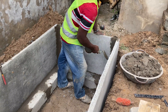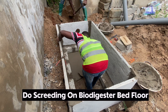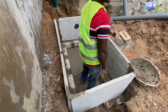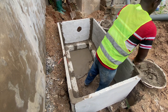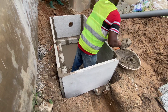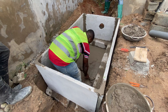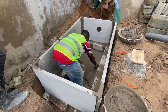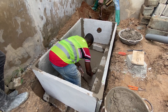The screening is being done at the same time as the porous slabs are being laid on the ground. We are using porous slabs in this case because we want extra enhancement — we want the filtrated water to look cleaner and be good for dropping into the soak hole pit or soak away. Sometimes clients want to use this wastewater for other purposes like gardening or watering plants in the compound, so you have to make sure the filtration is done right.